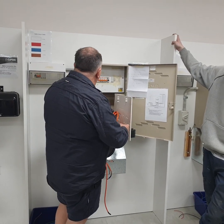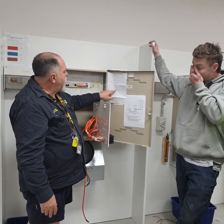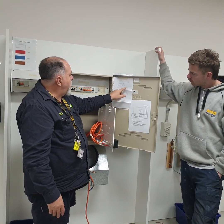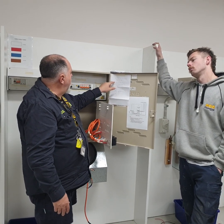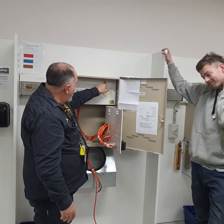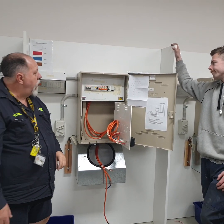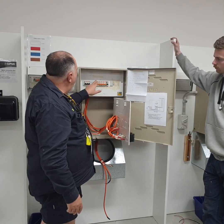The other thing we need to do now is make sure he's got his labelling, do not remove. It's got the street address, it's got a plan of where the mains are, telling me the size of the mains coming in, 6 mil, explained as on the project, telling me all the information that I need. Up in the top corner here too, he's put main earth electrode located below panel. That needs to be in there. That's a wiring requirement as well, and I'll show you that on the visual defects one where it's actually located. So that needs to be labelled in there.